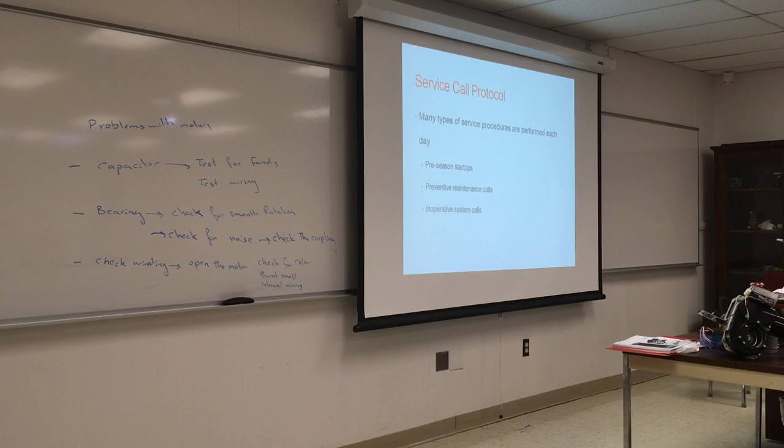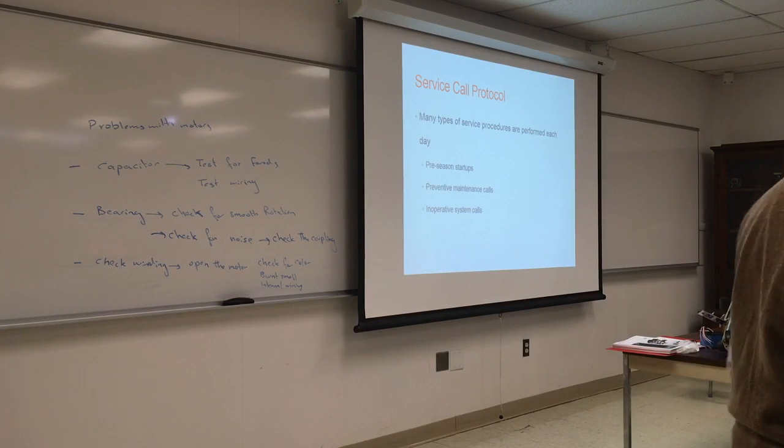And in that case, what would you see? You're going to put your clamp-on meter, and you see a very high amperage draw, because it's called the locked rotor amperage. If you look at a lot of motors, they have two types of amperage. Something called locked rotor amperage, I don't have it here, but if you have a pro compressor, it'll give you the locked rotor amperage and the running amperage. So the running, for example, will be 2, and the lock will be like 6 or 8. I mean, it's locked. The motor is running, but it's locked. So turn it off and go and check the component inside.